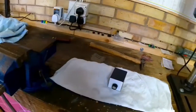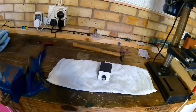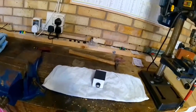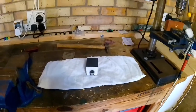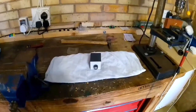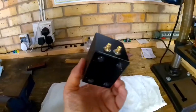I'll need to test it, and what I think I'll do is try and find a constant radio signal and put this in series with the aerial and then just see how it reduces the S units on receive. As a very basic test, until I get my signal generator on it with my spectrum analyzer, and I'll be able to look at how it drops down with that, or even my VNA network analyzer might do the trick as well with the signal generator, because I can put it straight through and then I can adjust it and it should drop the amplitude down on an AM signal, and that would be a good test. So not a very good video this one, but thanks for watching.